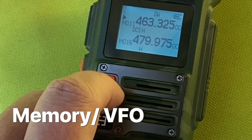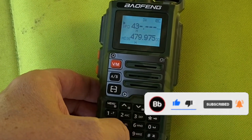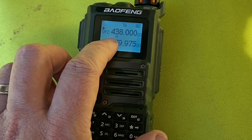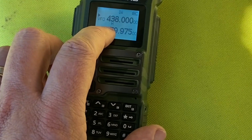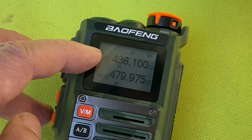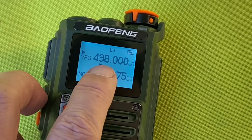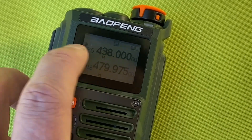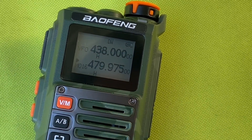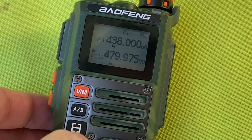So here I'm in memory mode. If I change that to VFO mode, I can now type in a frequency — let's type in 438000. Now I'm on that frequency, just as simple as that. You can see I'm PTTing there. I haven't got the antenna plugged in, but I'm still able to PTT. So in VFO mode I can type in a frequency, put on tone squelch and everything I want to do. Once I'm happy with that, I can save it in a memory channel with all those settings. Usually you type everything in or program it via a computer and then save it to the memory channel. So most likely you'll be in memory mode most of the time.